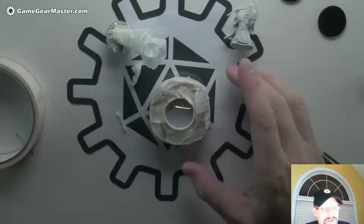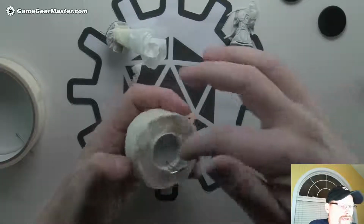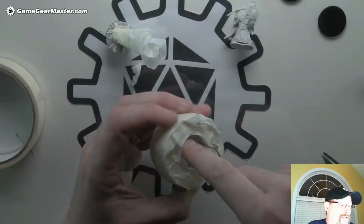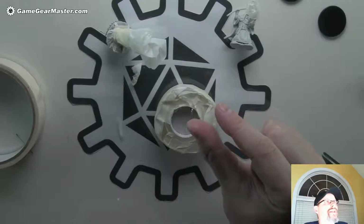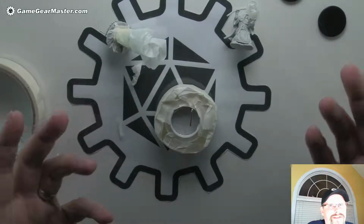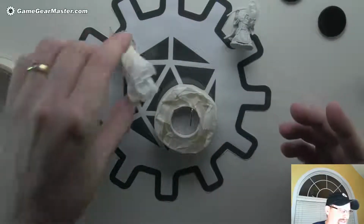So, okay, we're gonna pour some hot glue in here. Now the idea is we wanna make sure that all the hot glue evenly covers the entire bottom, which means we wanna make sure it gets in these creases here and also behind the needle. And you wanna have probably about that much, like 1/8 of an inch. Don't worry if you put too much in. The only downside to putting too much in is you have to put more pressure on this. More is gonna seep out of the sides.